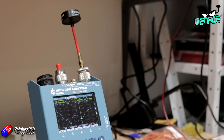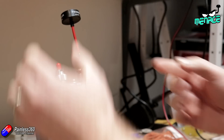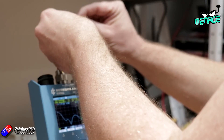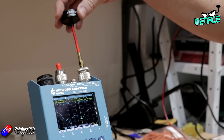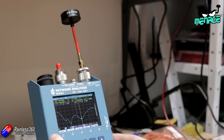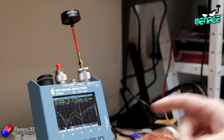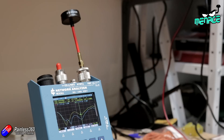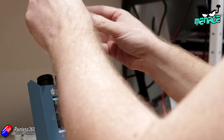Alright, let's bend one of the lobes. We take the cap off, bend one of the lobes out of form, pop the cap back on so we can compare it to the base run. So what we can see here is that our tuned frequency — the dip — is still in the same tune, but the VSWR has come up by moving one lobe. Let's save that one.